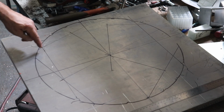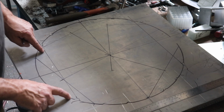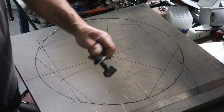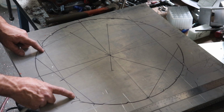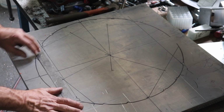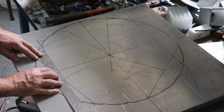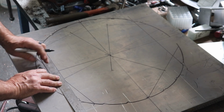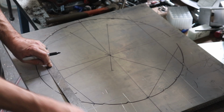And basically what I need to do is I need to manually drill 4 holes. The next step that I did was I measured perpendicular lines and then figured out where my 4 1/2-inch bolts are going to go into T-slots that are used to bolt things to the table of the mill. And I'm manually basically finding these locations because I need to use the drill press over there to actually drill these holes. So the final step is to find the plus or minus 5 inches on the center of this T-slot. And I'm just using this old ruler that I have, and I am setting the perpendiculars on the line. So with 5 inches here, I've got 10 and 0, and I'll do the same on this side.